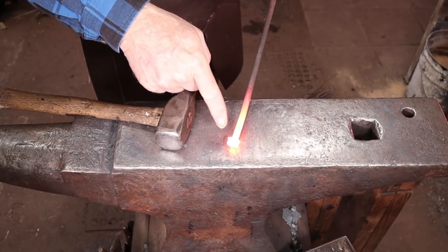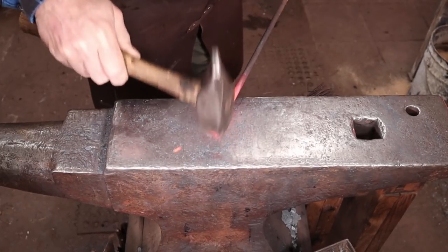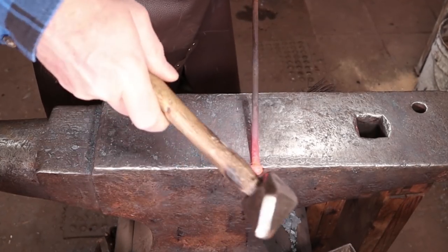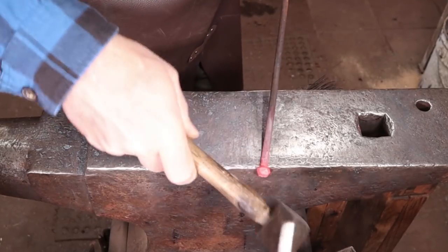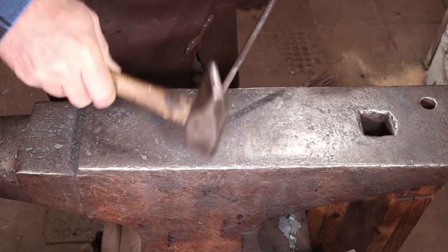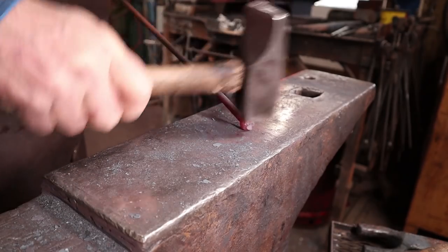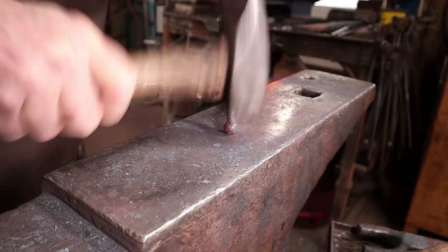There were also some suggestions to just leave the bolt head instead of going to a ball. Personally I kind of like the ball idea better, but if you're making one, it's your hook — you do it the way you want to do it. If you leave more of the thread showing on the other end, leaving the bolt head might be an interesting thing so people can tell it was a bolt. Of course you can make the same hook without starting with a bolt — you can do it out of round rod and upset the end, or lots of other ways. I'm just going to do this one entirely at the anvil just to show that you don't have to have a swedge block to make a reasonably spherical ball.